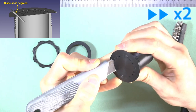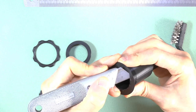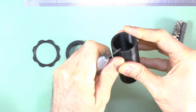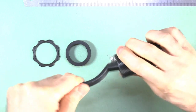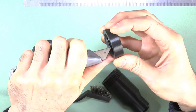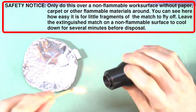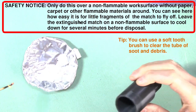Note that I am angling the blade at about 45 degrees as I do this. Once removed, scrape the remaining surfaces to get rid of any stubs of plastic. Brush and scrape all the models to remove any stray plastic threads. Pay particular attention to the seam on the inside of the ocular cap, as the fit of the eyepiece sleeve might be too tight due to this one spot and it could damage the coating on the sleeve of your eyepiece if you don't smooth it out properly. If there are any tiny plastic threads left in the monocular tube, burn them off with a quick passage of a naked flame — but this must be very quick or you will deform the internal light baffles and apertures. Clean away all soot and any debris from this operation afterwards.